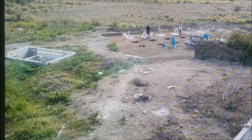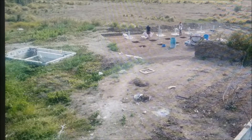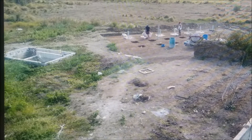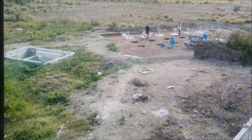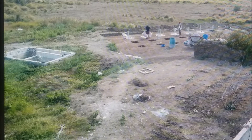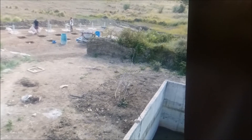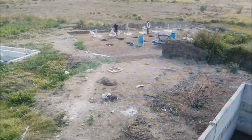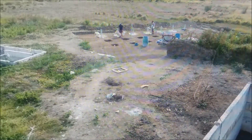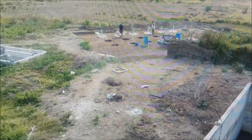You'll see the relationship to where the septic tank is — that's the concrete structure on the left with the walls in it. You can see some partition walls that aren't full height, which is pretty close to the water level. The other space with the higher divider wall is where ducts run through past all five places that need air. And over on the right you can see the corner of the water cistern — 37,800 gallon size.